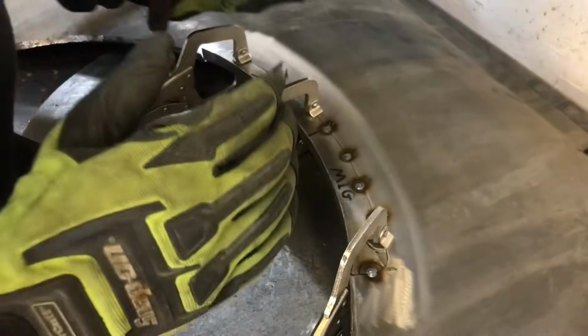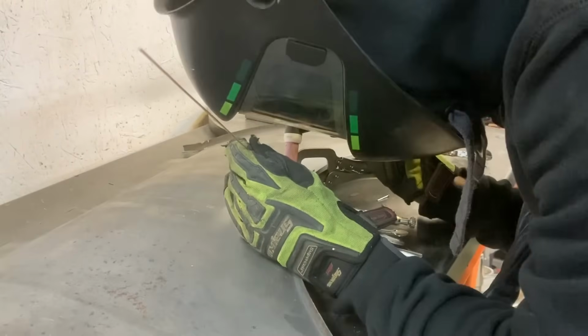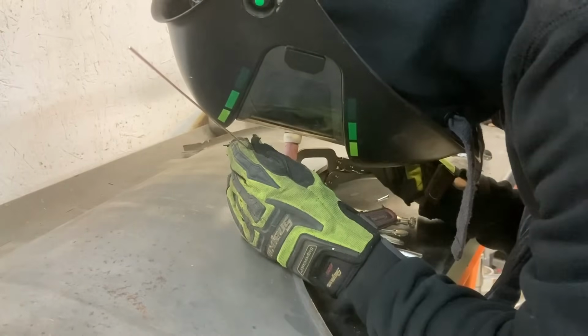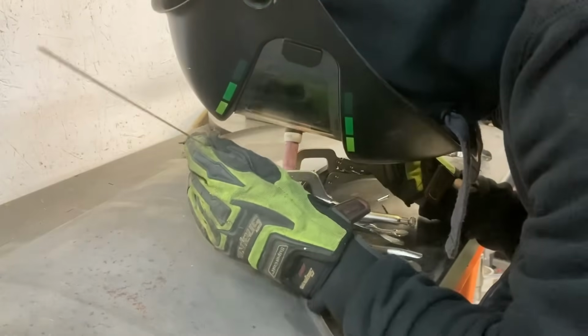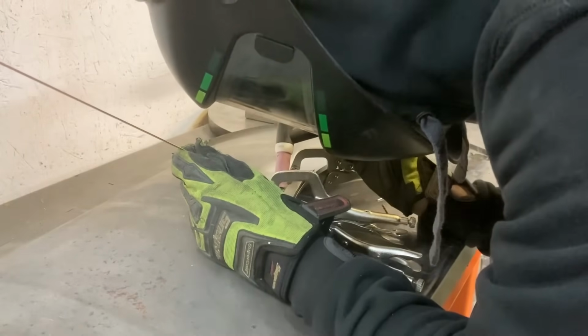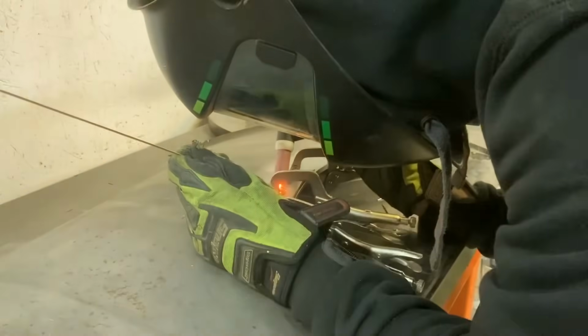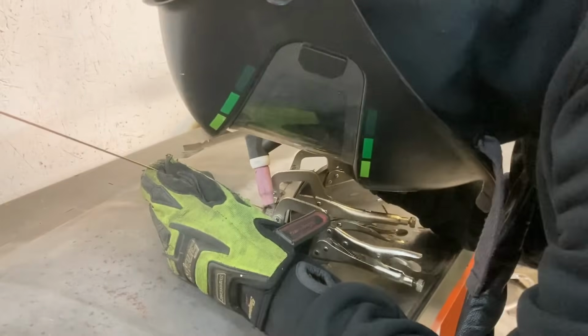And that is all there is to it. Okay, so now on to the TIG welding. I aim to fuse the two bits together using as little rod as possible. Only when the material starts separating will I actually apply a bit of rod, because I aim to just fuse the two bits together. I don't need to cool any of the weld down on this one like I did with the MIG, so there's very little heat generated.